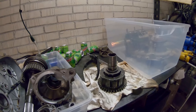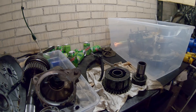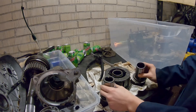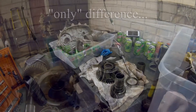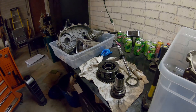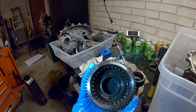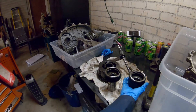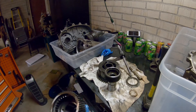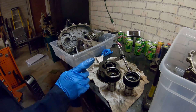As you can see, I've still got this taken apart because I was waiting on this input shaft, which I will replace with this new input shaft. You can see the difference between them — it's just the number of splines, that's the only difference. There's actually a bearing on the old one that did not come on the new one, so I need to make sure to swap that bearing onto the new shaft.